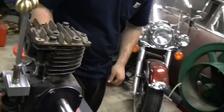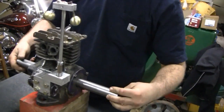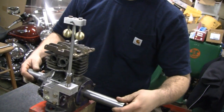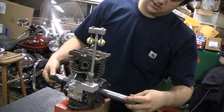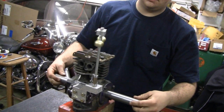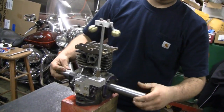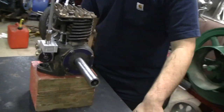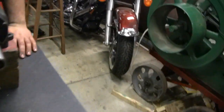Show them how the governor balls work — they actually work pretty good. Just spin it real easy, Mike — barely turn it and see the balls going out. So they're going to work well. When the engine is running at constant speed, the spring holds them back, but they'll fly right out — that's where 'balls to the walls' comes from. That's what we got done today. We spent a good eight to ten hours on this one. It takes a lot longer than people think — a lot of machining, everything is machined and fit.